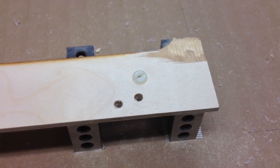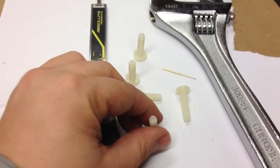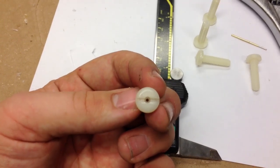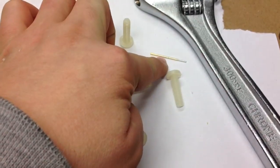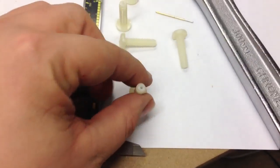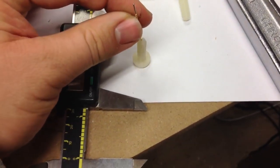I am just finishing up manufacturing the pogo pin holders, the holder bolts, and you can see what I've got here. So essentially what I did, I just countersink a little bit of hole, because it turns out that the 1-inch bolt is just slightly longer than the shank on this pogo pin, but then I just slightly oversized the hole so I could get this in here.